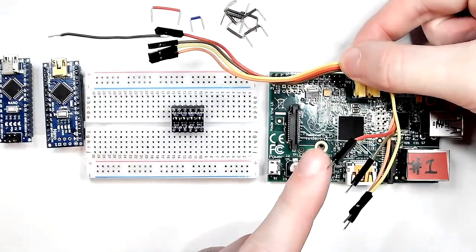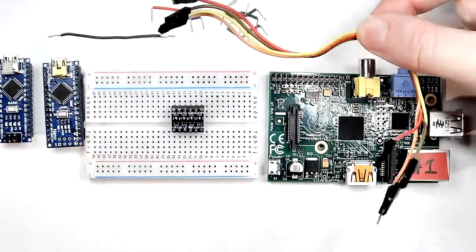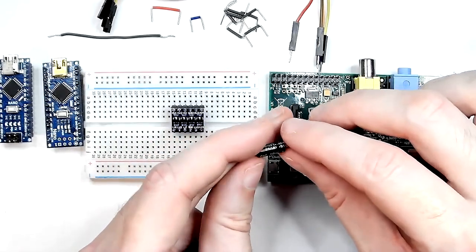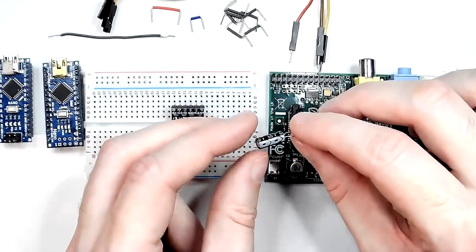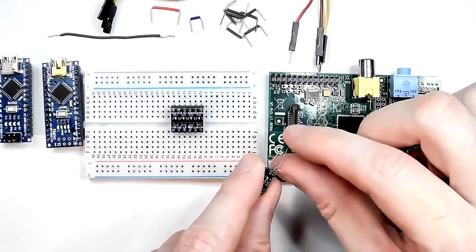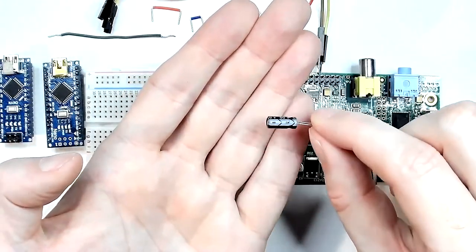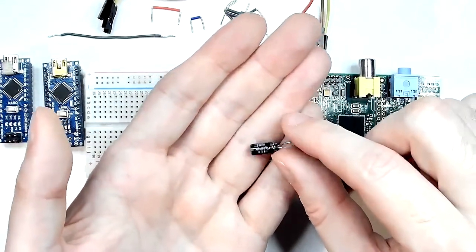We also need female-to-male four-way jumper cable in a ribbon, with pins on one end and sockets on the other, to bridge from the breadboard to the Raspberry Pi GPIO. The next item is optional: a capacitor — either a ceramic disc 104 or a 10uF 50V electrolytic capacitor. If you use electrolytics, remember they are polarised: the stripe indicates negative. This component is completely optional but helps smooth out the circuit and any voltage drops or interference, preventing line chatter between the Pi and Arduino.